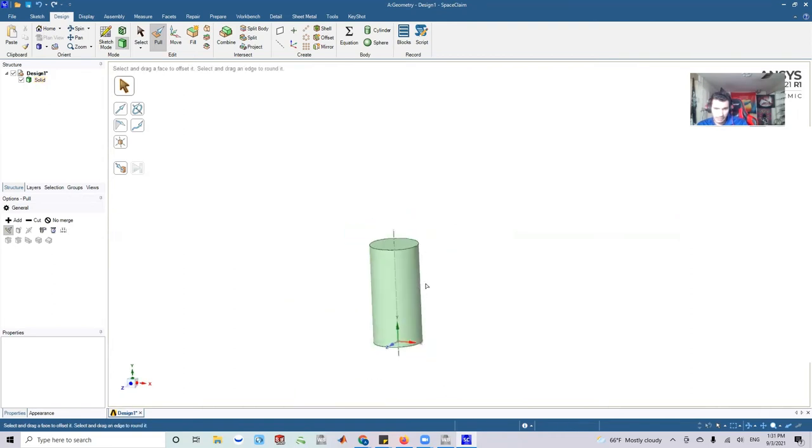The resulting shape is a little too thick, so I can go back and change that dimension. If you make an antenna — especially an omnidirectional one — extremely thick, you're basically allowing more frequencies to be captured. Instead of making it narrow, making it wider increases the bandwidth.